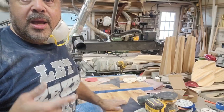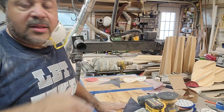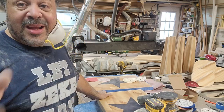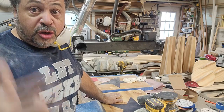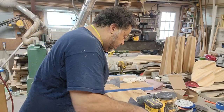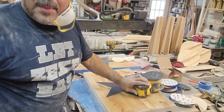So here's what I got right here. This is epoxy resin — this is a butcher block. I'm going to be giving this away tonight. I poured the epoxy resin on there. There's some waves and things like that. So I started out with 150 grit sandpaper, sanded it all nice and flat, went from there to 180, 220, 280. And now this is 400 grit that I just did. And you can see the big scratches are actually out of this now — the big ones are. But it's not polished.